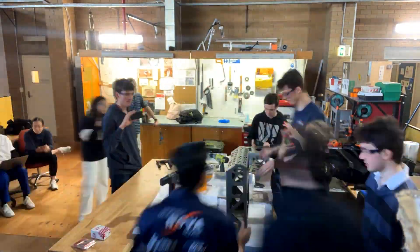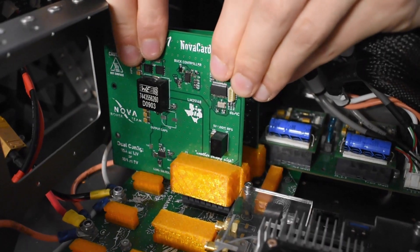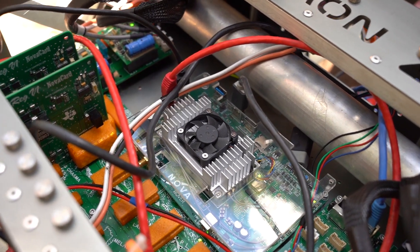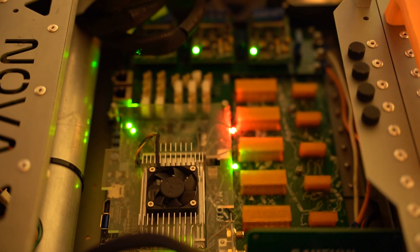The chassis body has been redesigned to reduce core weight and accommodate larger arm and science payloads. The new body increases space for the electrical system, now featuring board-to-board connectors to allow modular expandability. At the core of the new electrical system is our custom compact Jetson TX2 carrier board, which hosts three USB 3 ports and has vertical connectors to improve accessibility.